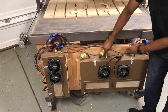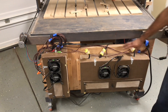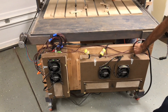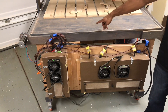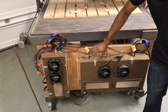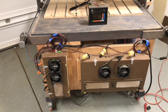I would have wired all connections through one box had I known I needed three from the beginning. We're going to connect the actuation — all the power for the water cooling is in here for the spindle, but this is just what actuates and gives me a remote on my offline controller. All that's left to do is plug in the power. In this power enclosure is where all the power is housed. The power for the spindle, the CNC, the cooling fans, the water cooling, and the fans that cool the water cooling for the spindle all run through this one. These are two separate circuits, meaning two separate breakers. Now that we have our offline controller connected, let's plug it in and turn on the system.